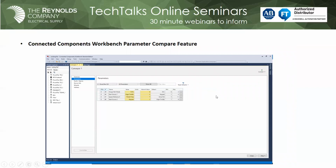And I've seen customers, after they commission their drive, actually print that out. They've even laminated it, hung it next to the drive, or put it in the control cabinet. So if second or third shift has to change the drive, they don't have to wonder what they need to do with it. They know exactly which parameters and what those values need to be to get that drive back up and running quickly. So it can really cut down on commissioning a new drive that's standalone.